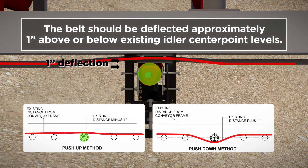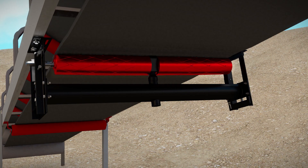There should be sufficient tension to make it difficult to pivot by hand prior to startup. In general, increased angles of wrap will improve traction, resulting in improved performance. Increased traction is only needed if the True Trainer is not working correctly.